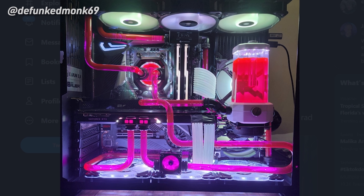It's almost a little bit too ambitious for his patience level. Or, I'm just going to say patience and skill. It would take an extreme amount of skill to get this many bends perfect. Perfect. Like all 90s, period. All 180s. Yeah. And not only that, the longer it is like this, once you put fluid in it, this gets weight as well. So to do that right, you probably would have had to have it come up slightly so that once the weight is in there, it sags to level. It might have been level before it got filled and then it sagged. But I just think this might be one of those instances where less is more.